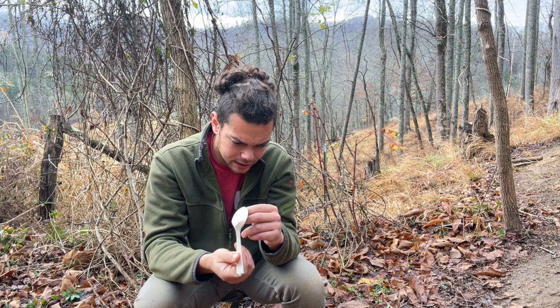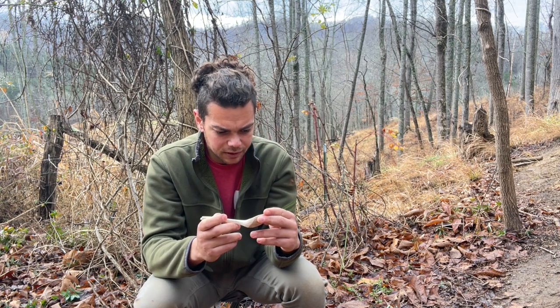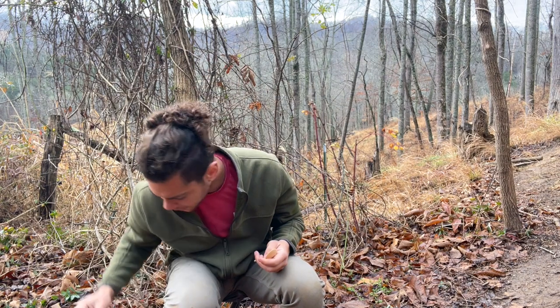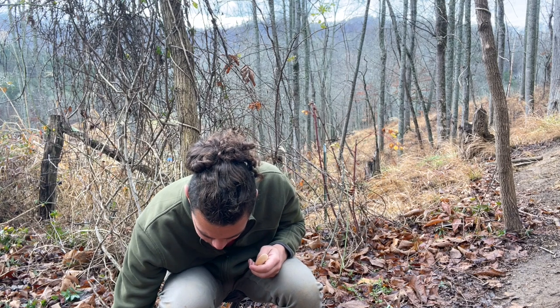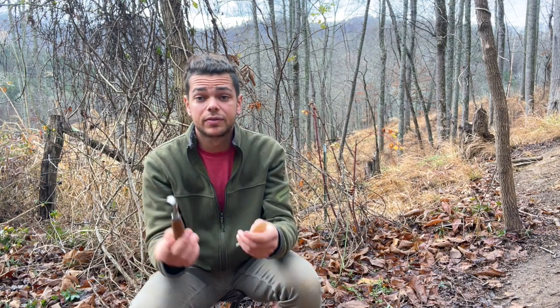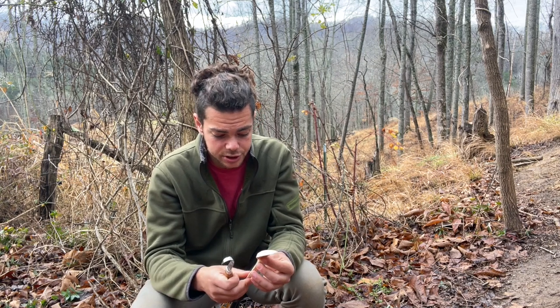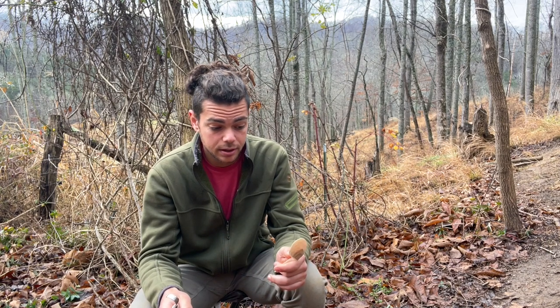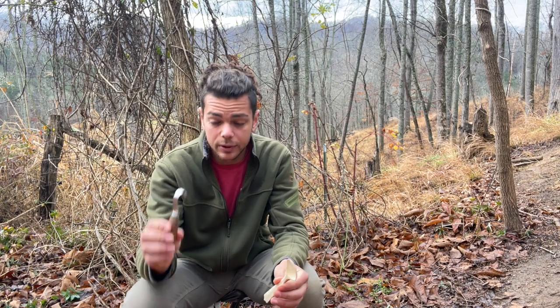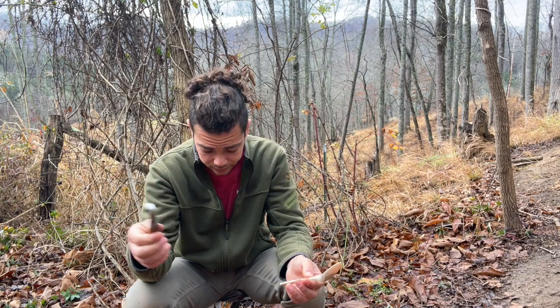This actually looks pretty good. It doesn't look like it's changed much, but the first thing I'm going to do is clean up the inside of this bowl. Whenever you're doing finishing cuts on this dried wood, you want to make sure your tools are very, very sharp. Either have a second set of tools just for finishing cuts, or go ahead and get everything polished up and sharp before you do these cuts. I went ahead and honed my spoon knife and my slöyd knives.